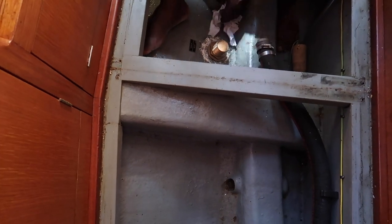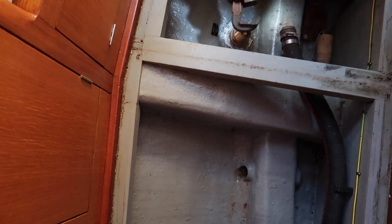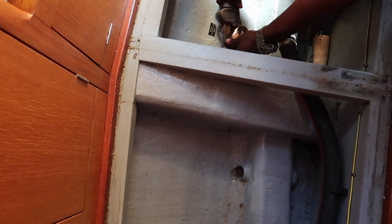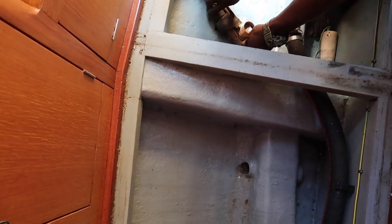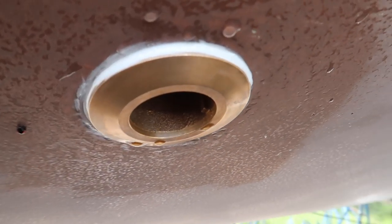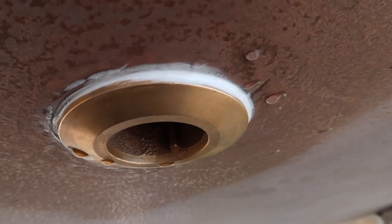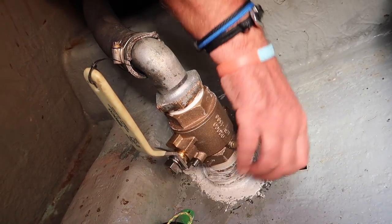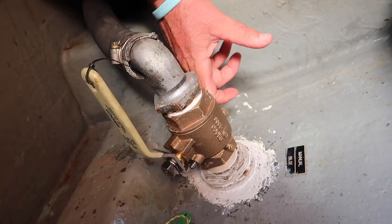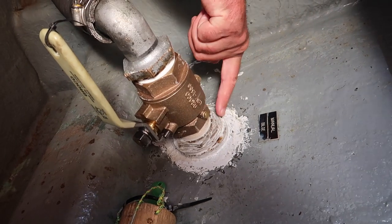So here's a piece of wood that they're putting up through to stabilise it as he can tighten it down. This is what it looks like when it's nice and flush, and all the 5200, as you can see, is a nice seal around it. The button mushroom fitting is through on the other side. It's come up. There's the female fitting here, which is this threaded bit here.